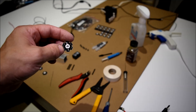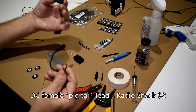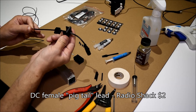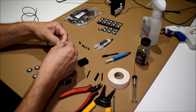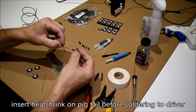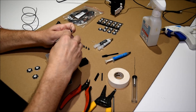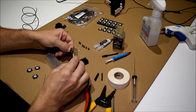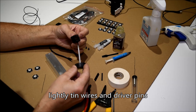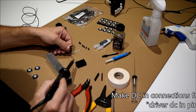Or if you're like me and want them removable, go ahead and tap it. This is a speed build so it's moving really fast — if you end up wanting to build this thing you're probably going to have to pause the video. We start out with a DC female pigtail lead that's going to attach directly to this tiny DC-to-DC bucking driver — it's a $6 driver, so order a couple in case you screw one up. You want to tin all your wires; I use liquid flux and tin all the different connections. I like this little bucking driver because it's going to fit in the aluminum heat sink.